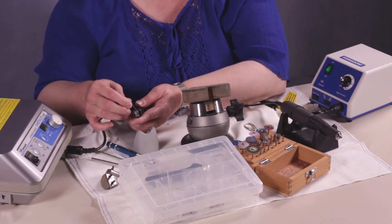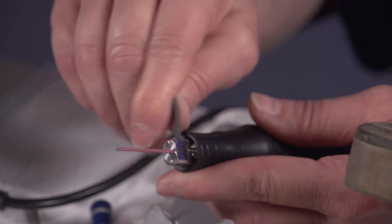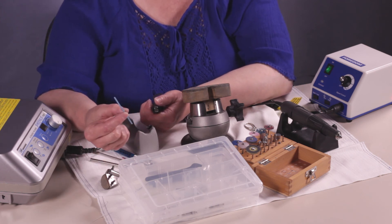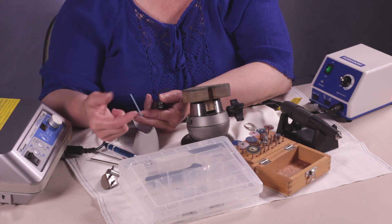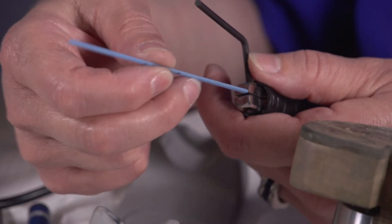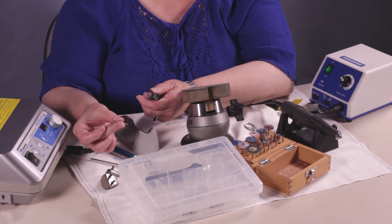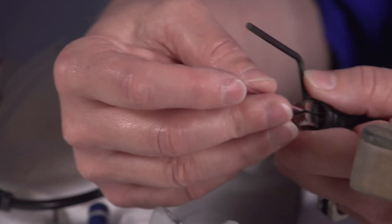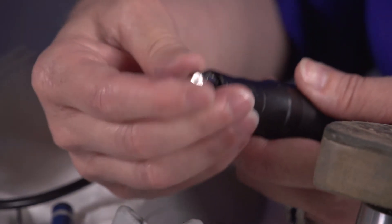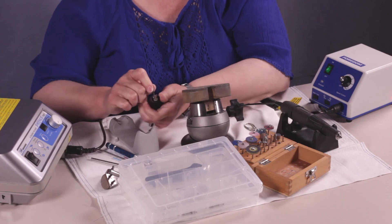The way you're going to change your tool is, we're going to turn it off. And if you use your Allen wrench, put your tool in and select which one you want. These come in four inches, and I usually break them into three sections — you get a lot more use out of it. If it's too long when it's in the machine, it's actually going to work itself out; once you start working with it, it just starts shifting because it's so long, and it's not as aggressive. So break the little sections into about three sections and place it in there centered and tighten it. If you tighten it too tight, it'll overheat and make noise. And if it's not tight enough, it kind of makes noise and lets you know that it's just not tight enough.